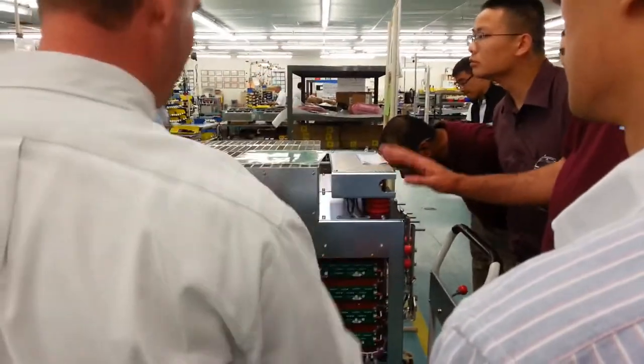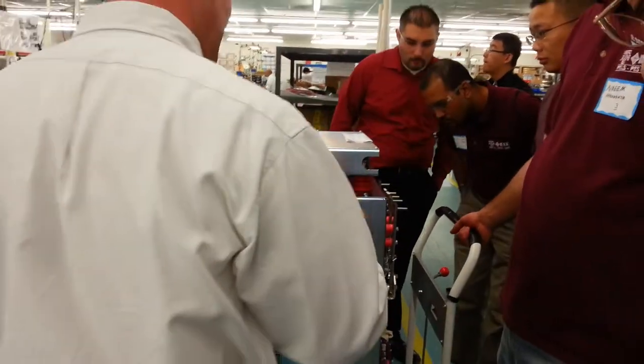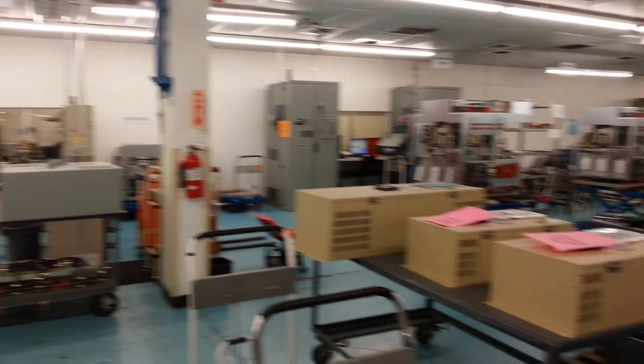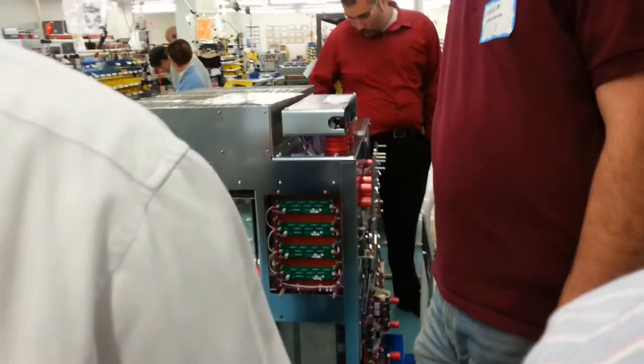We'll see the raw ones over here. This is a drive — but these are just modules to help you parallel to get a larger size. It could be a 200; you want a 600, just three of them — you just parallel them. Actually parallel modules. The voltage will still be 690 in this case, but for the larger modules you just parallel them up — one per phase, two per phase, or whatever.